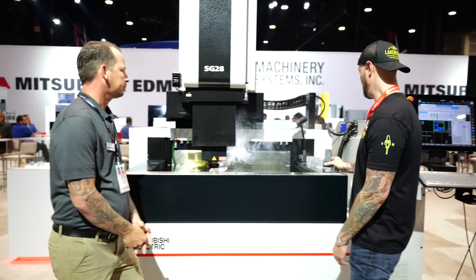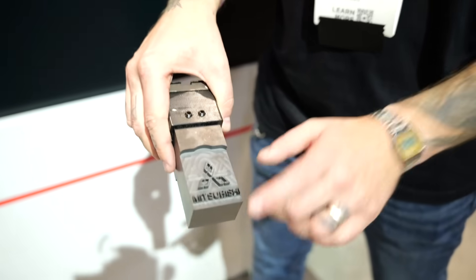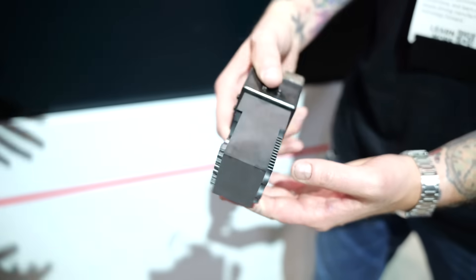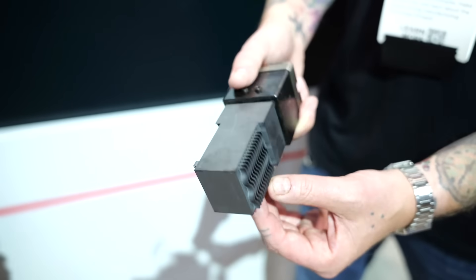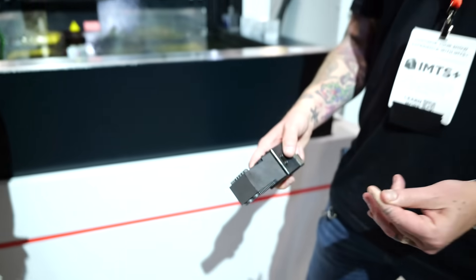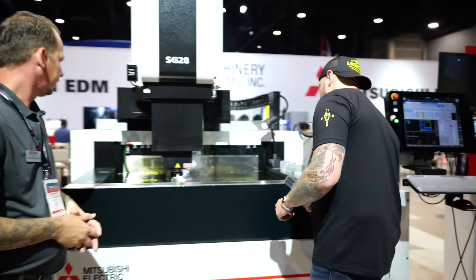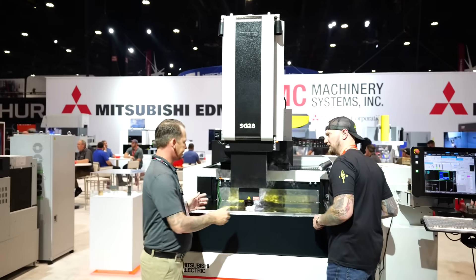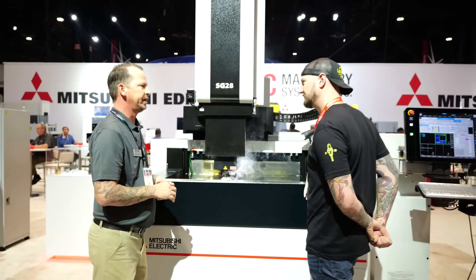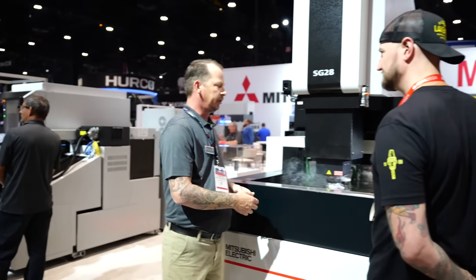The nice thing is you can do those sharp corners that you can't mill — very accurate, very repeatable, as long as you're staying on top of your electrodes. So I'm going to grab this right now — I believe this is graphite, that's right. So this is what we're burning in there today. You would do this on a mill first, right? Yeah, we have a special graphite mill that has completely sealed ways and bearings and a nice dust collector. A lot of people don't want to machine graphite in their shop because it's messy and detrimental to other machines — better to have a dedicated machine. So how big is that table? This is about 30 by 20 travel. This is one of our larger sinkers, the SG 28, large format — this gets into turbine work, you can fit a lot of different fixtures on there for production.